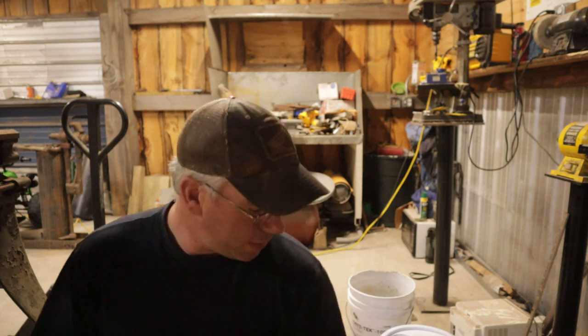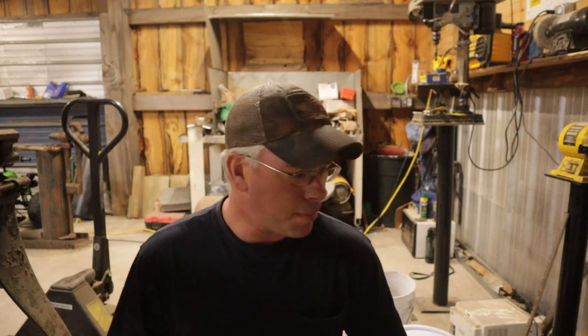Now when you put cast iron or wrought iron or anything like that, and it's really hard to find wrought iron, on the grinder, it's just going to be a dull orange grainy spark. You're not going to get the big sparkles at the end that you get with the steels. Steel contains carbon, and that's what separates it from iron. Obviously steel is made with iron and carbon, but you get what I'm saying.